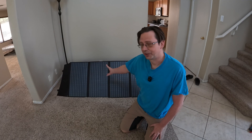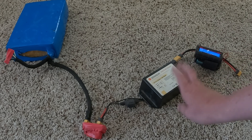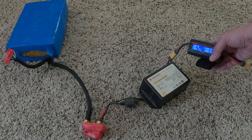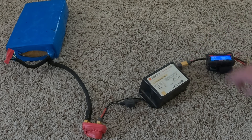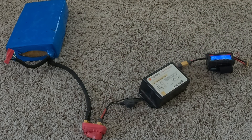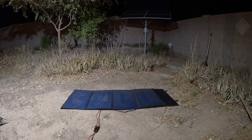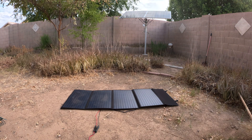I'm not gonna gather any solar inside the house so I'll show you my test rig real quick. My test rig is a basic system — I put the meter on this side so basically you're not measuring the performance of the controller, you're measuring the performance of the panel at that point. This is a much better way to show you the efficiency of the solar panel. The solar panel comes in, goes into my meter which I got battery backup hooked up into, so at night or in shadow it will keep my stats. This goes into a very high-end MPPT controller, and from there it goes into the battery. The battery itself is what I call a solar battery — it has a common charge and discharge port. I'm basically going to wait for the sun to come up, place this out there, and do all-day tests to see its maximum wattage and how much total wattage it's able to pull.